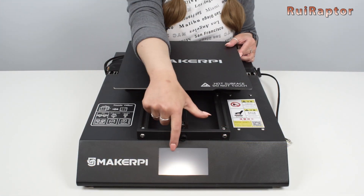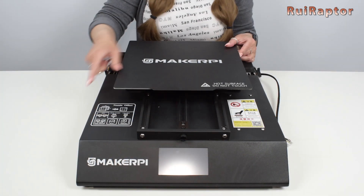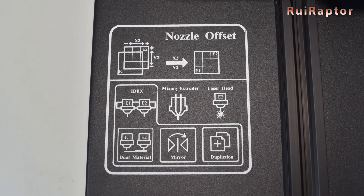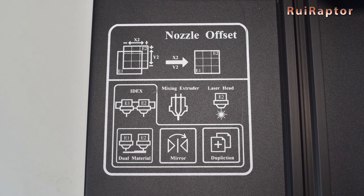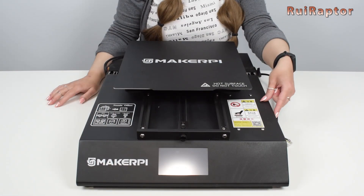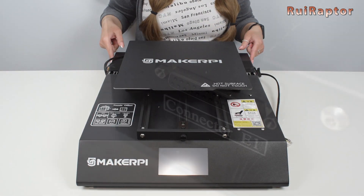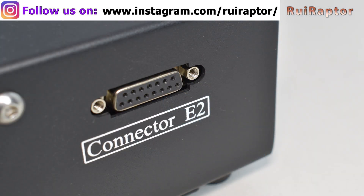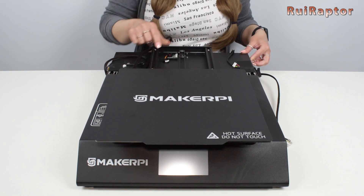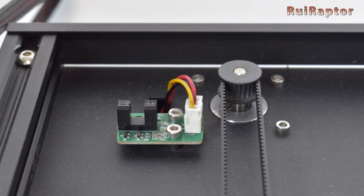At the front is the color touch display and the Y-axis belt tensioner. At the left side are a couple of USB connectors and next to them is information written about each head's position — E1 or E2, their offset, and so on. At the right side is the power supply voltage selector. At the back are two connectors for the long cables. The Y-axis runs on wheels, and also at the back is the end stop switch. This and all other end stops are electronic instead of mechanical.